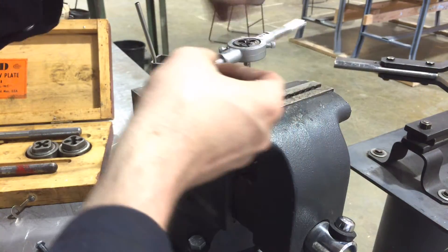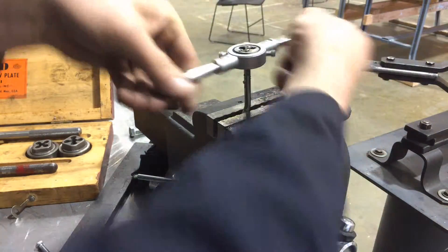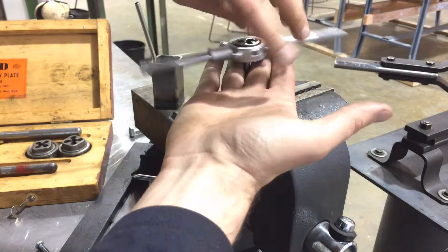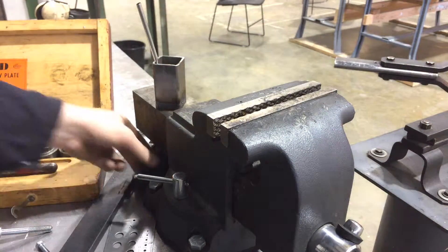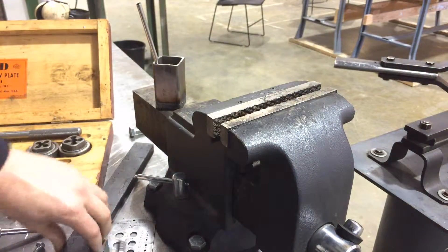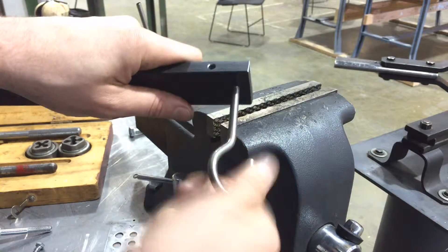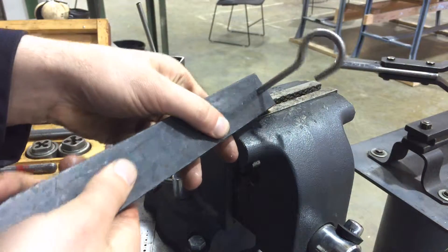That's a good trick if you don't want partially cut threads sticking out of your object. You're not doing a whole lot of cutting — just trying to complete those last couple of threads, so a couple of turns and you're good. Feed the die stock off carefully, and hopefully you've got your threads cut accurately. Clean them up with a little rag and some air. Here are our threads on the threaded part, and here's the threaded hole we did earlier — you can see we can thread that piece right on, with threads going pretty much right to the shoulder.